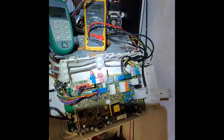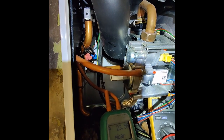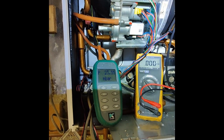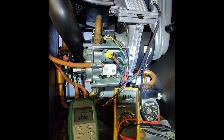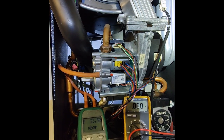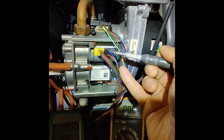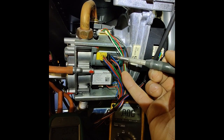I've removed the cover now and the PCB cover as well. What I've done is connected the U-gauge or electronic manometer to the inlet side of the gas valve. I want to establish whether, during the ignition sequence, it's actually using any gas - that will confirm if the gas valve is opening. I've also got my multimeter ready to check the voltage on the gas valve itself, to make sure the PCB is sending the correct voltage to open it. We're checking voltage on two different points on this gas valve - this black connector here has live and neutral.